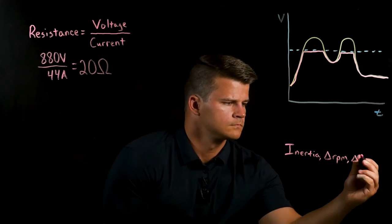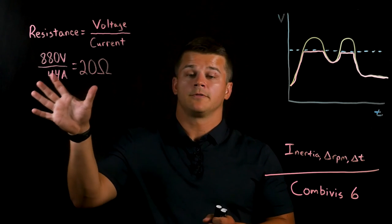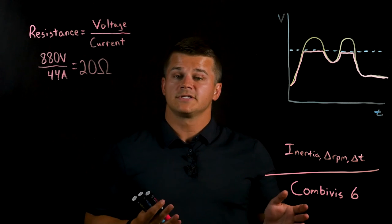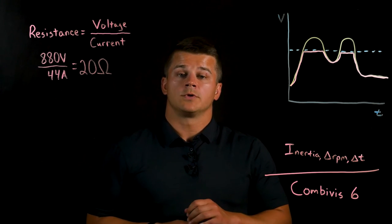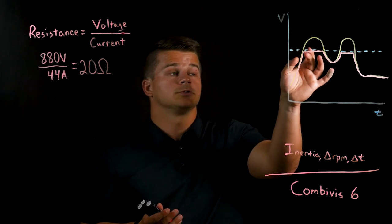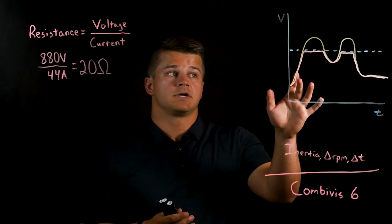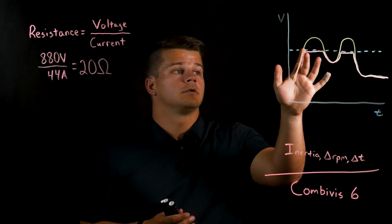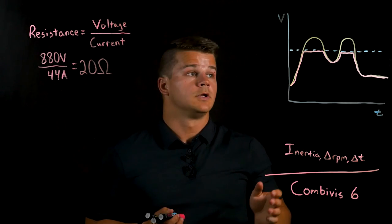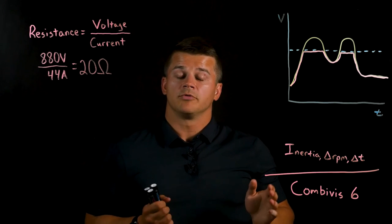The second thing you need to look at when sizing the braking resistor is the required power dissipation. We've talked about the minimum resistance value, but now we're talking about power dissipation. This needs to be calculated because when the braking resistor is working correctly, your DC bus voltage will plateau. If it's undersized, rather than plateauing, it can continue to rise because it doesn't have the available power dissipation for what the motor is generating. Thus, it's crucial to calculate what is needed beforehand.